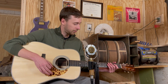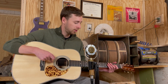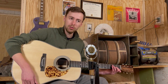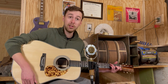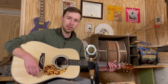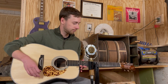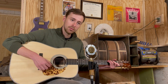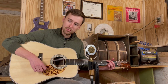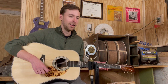Let's see. And forward shifted, X bracing, scalloped. I've got plans from John Arnold of his personal 1937 D28. So I get my braces within a few thousandths of that normally. And the sound is satisfactory, in my opinion.